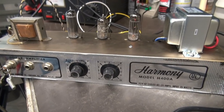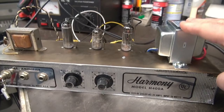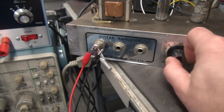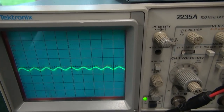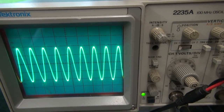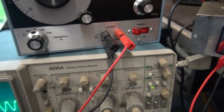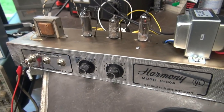Here's the initial test of the amp after the upgrade to the 6V tubes and the standalone power transformer. Here's the volume, here's my tone. I'm monitoring with the scope and using an audio generator for the input. There's the output of the amp right there. The tone on this one is just a high-cut tone control — so there's no bass boost, it just knocks out the highs. But she's working! So next step, let's get it back in the cabinet and see what it sounds like.